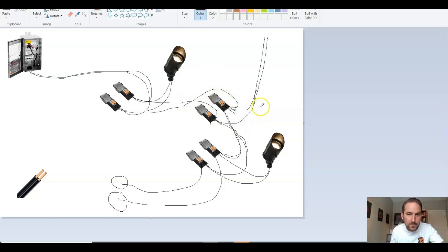So just to recap: 12-2 wire going in, 12-2 wire going in, 12-2 wire going out to one fixture, 12-2 wire going out to another fixture, and another 12-2 wire going out further in the field. You can use these connectors to T into a 12-2 line, to wire the last fixture on the line, or to wire any fixture in the line. That's a quick wiring diagram — I hope that makes sense. Now I'm going to talk about voltage drop.